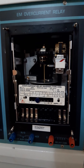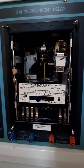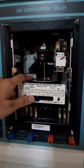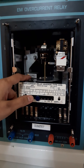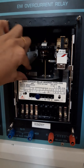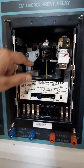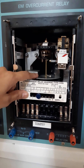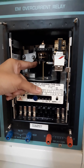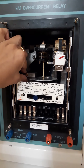This is the experimental arrangement. In this arrangement you can see the electromechanical relay basically consists of fixed and moving contacts. This aluminum spindle that you can see here is the moving contact. This moving contact has been placed between the two electromagnets. The moving contact is attached with the spindle, which can rotate from 0 to 360 degrees between these two electromagnets.